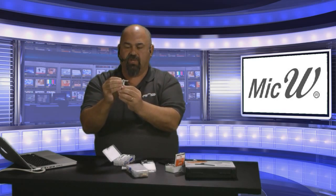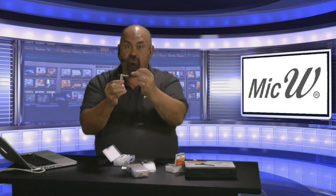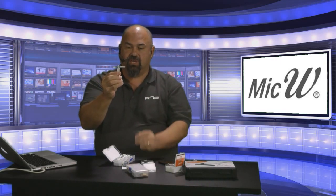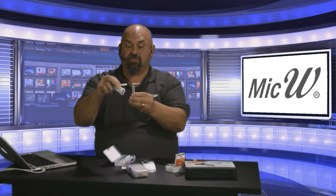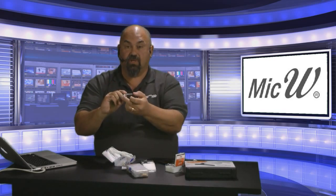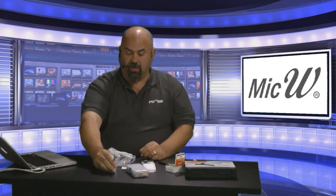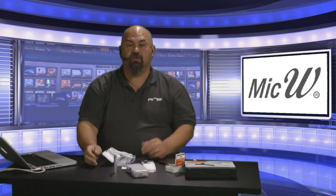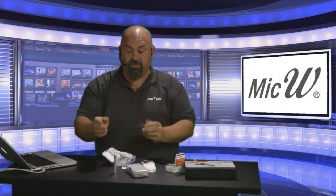You can insert the microphone into a shock mount. If you notice that there is movement in there, there's actually an O-ring inside that device, which allows me to take any shock, again, which was mentioned before. I would then attach my extension cable to the back of that. The most important part of this is on the bottom, there's a thread for your mic stand. So you could actually stand that up either on a tabletop mounted mic stand or on a regular mic stand and do your recordings completely separately to everything.